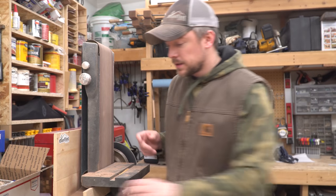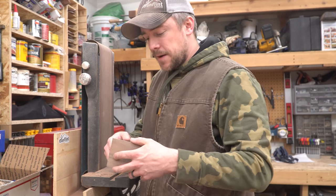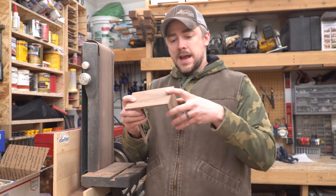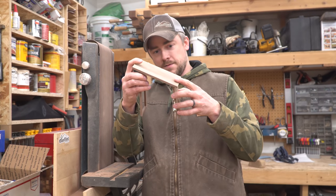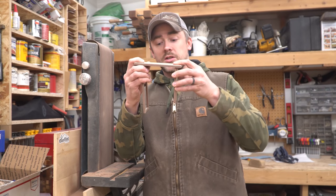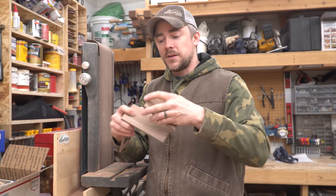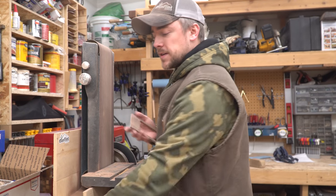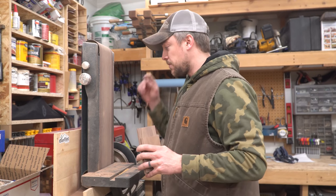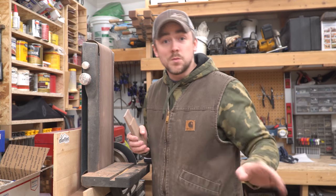There will be one other little trick to the top piece of the outhouse in that if I take the top and the bottom and put them in here, they're too square and they're supposed to sit at a very tipped degree, and when you lock them into that channel, they're actually too tight to get the bottom flush like it needs to be. So I'm going to have to bevel the top edges of the front and back outhouse pieces as well. But now that I've kind of explained that and showed it to you, I'm going to put my respirator back on because I really don't like the walnut dust in my lungs, and then we'll move on.